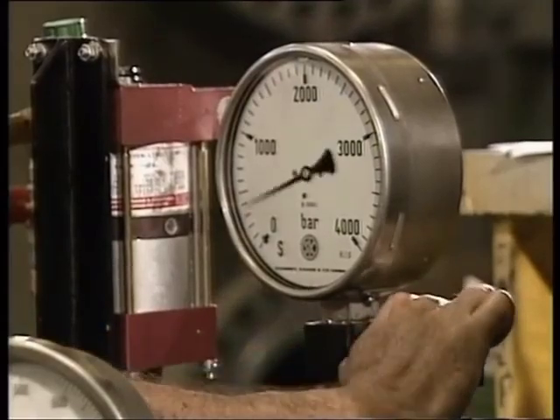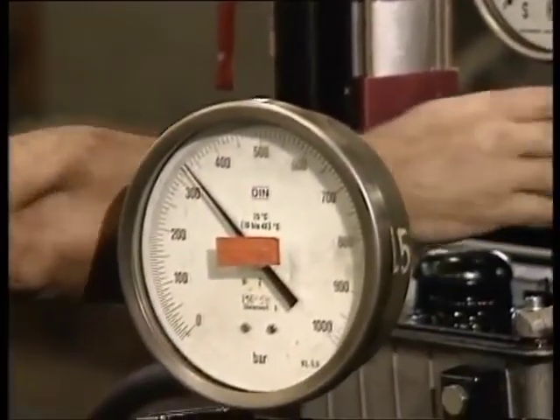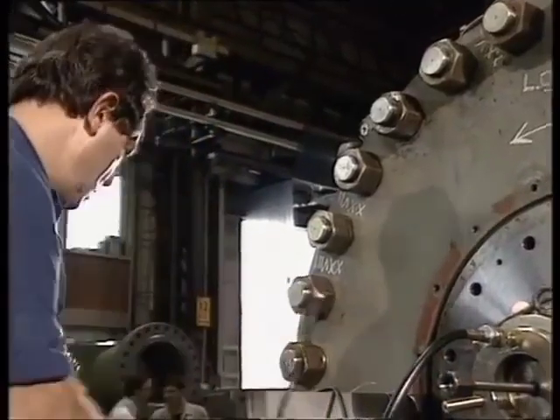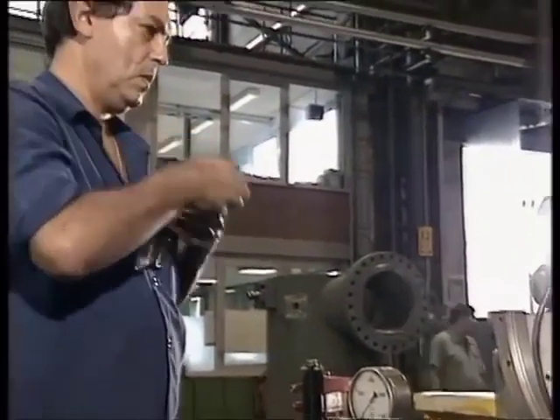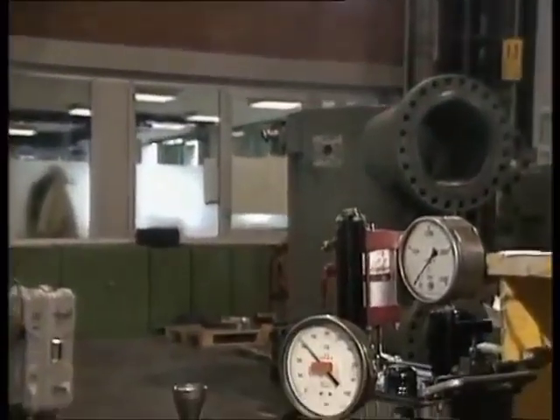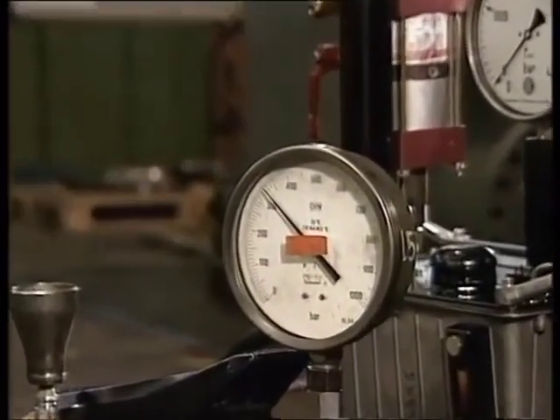By using both pumps, the collar is fitted in the right position with respect to the rotor. Prior to releasing the pressure which pushed the collar into position, it is recommended that it be held for about 10 minutes, as this allows the collar material to relax better.